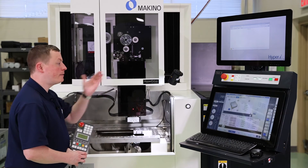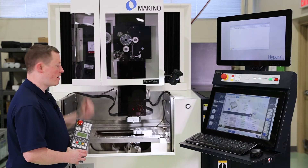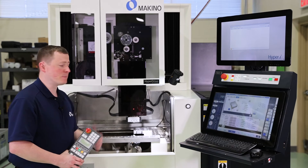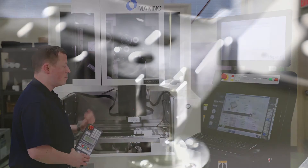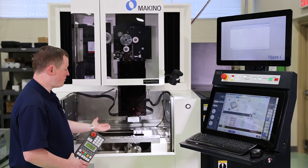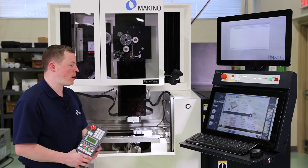Same thing will continue on. Run light turns on, wire feed turns on, and then you'll see the machine wrap it over and do its first pickup. It's going to pick up and move in X, pick up in Y first, then wrap it over. Now it's doing its pickup in X, and the corner find is going to end on the theoretical corner of the part.